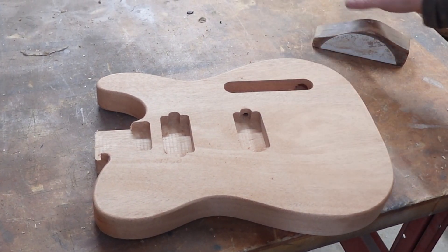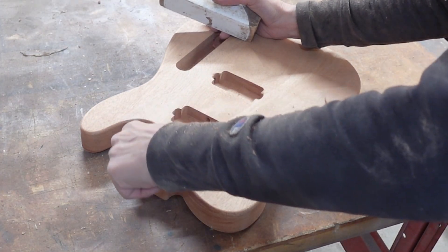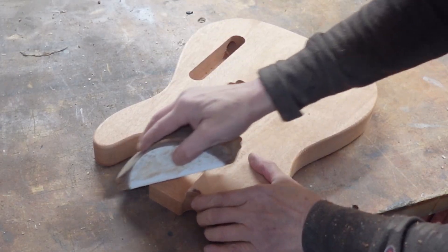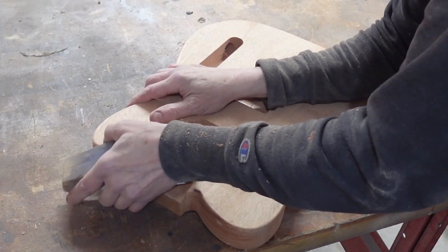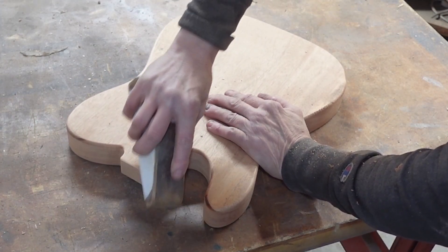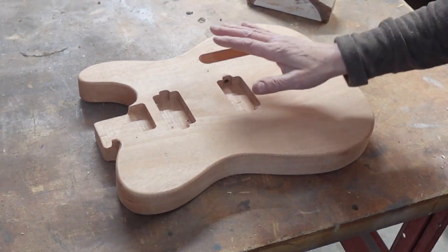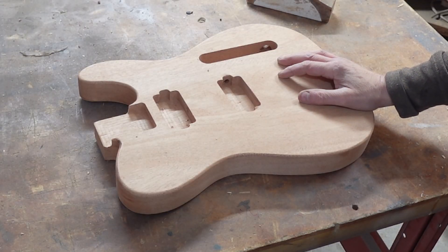Just a quick little part here on the hand sanding I do. I always like to break any sharp edges — so we have this edge here, this edge here, this edge all the way around here, and then this edge on the back. I just have some sanding blocks from scrap that I contact adhesive some 120-grit sandpaper to, and I'll just hit these really light. Flip her over and get the other side too. In my program I build in this radius here and this radius here, so I don't really have to hit those. Just a touch more hand sanding on this and then quality control will measure that, weigh it, stamp it, and all that kind of stuff — then she'll be ready to go out to the customer.